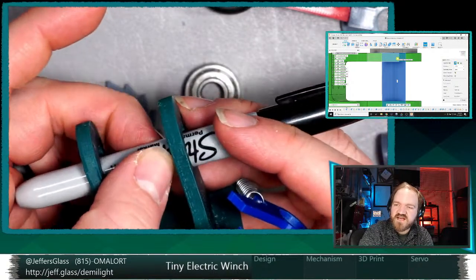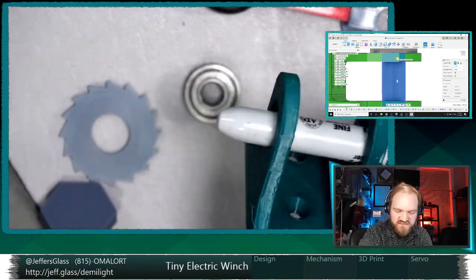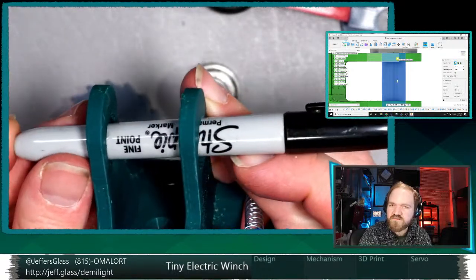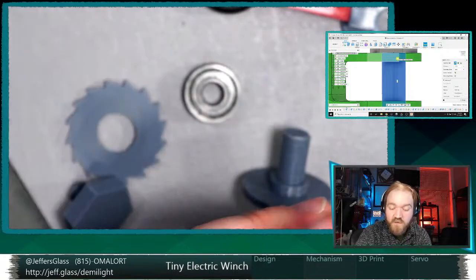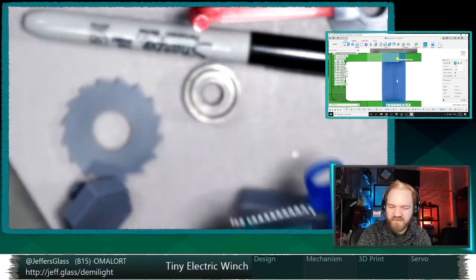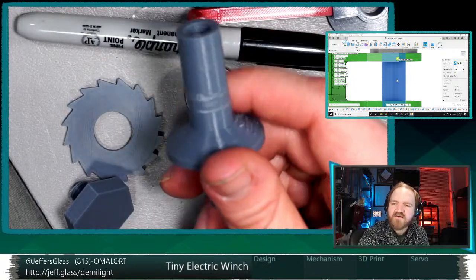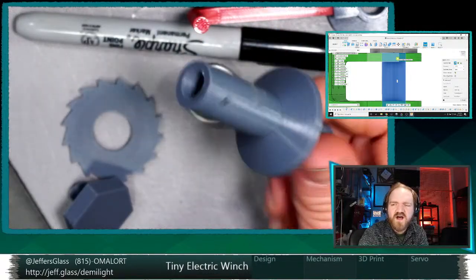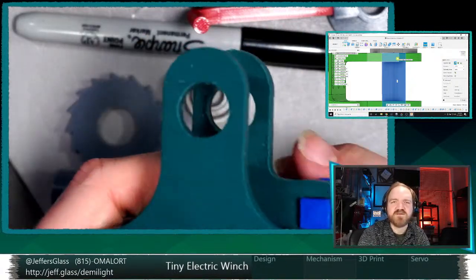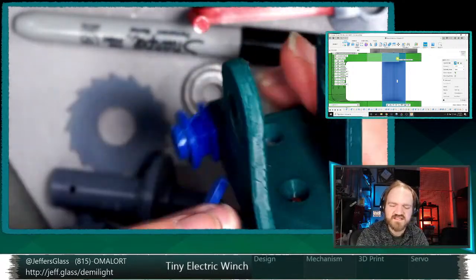We still have the question of whether an 8 millimeter surface is strong enough to support this. But I guess there's not really a great way to test that other than to just try it. And it probably would be fine. I was very impressed with how well this initial mechanism held up to load. I threw a pound of solder at it and it did just fine. I think the shaft I did with 3 perimeters on my 0.4 millimeter nozzle, so no additional infill. And then I think this was just my default 2 perimeters, top, bottom, and side, with 15% infill. Stiffness-wise, it held up okay.